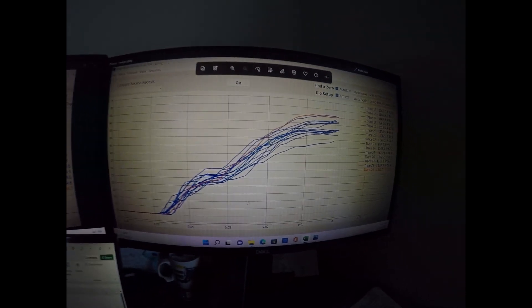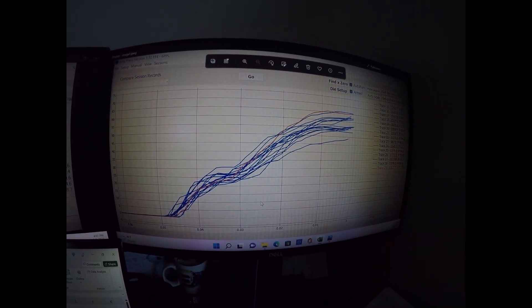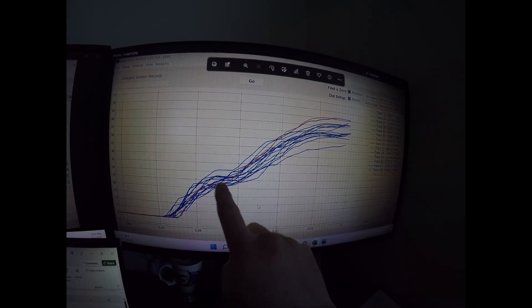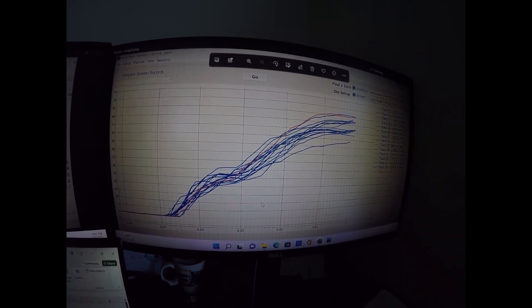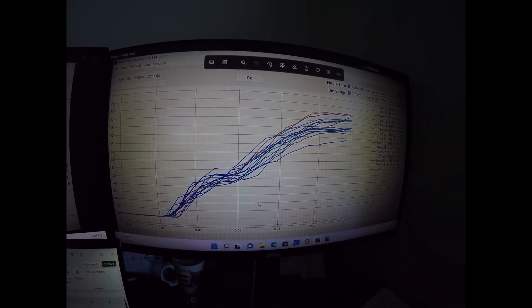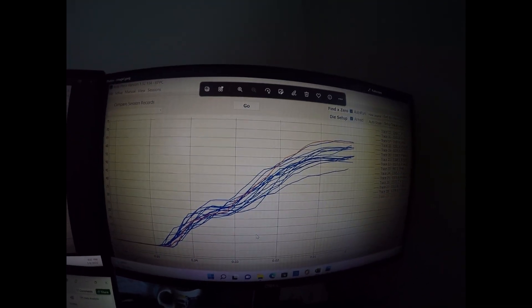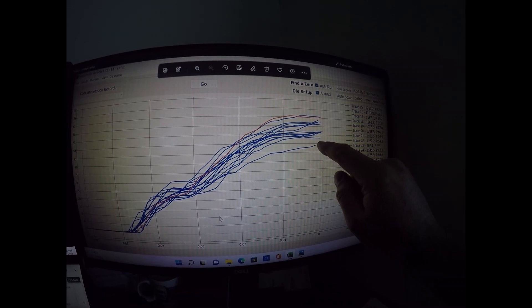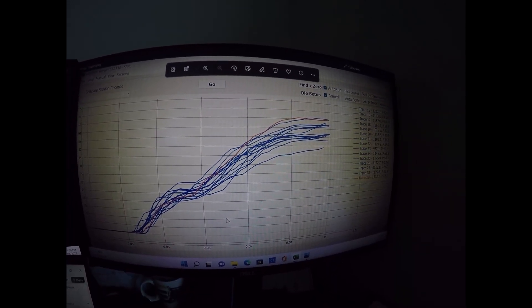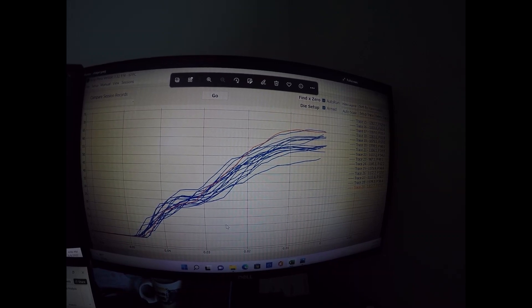For the cases that were not annealed, it showed a little bit of linear, but then it kind of leveled out a bit and then went back up. There seemed to be a more noticeable dip right around the middle of the seating process. You can kind of see it here. Not annealed brass needed less pressure overall to fully seat the bullet than the annealed brass — the range went from around 50 to 65.